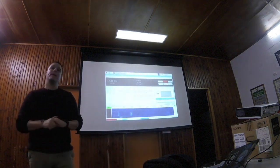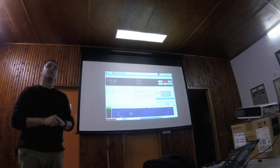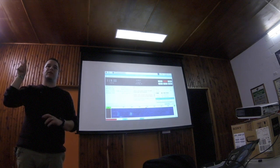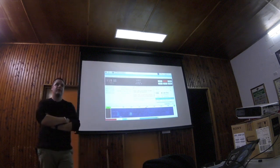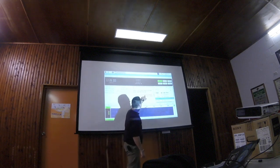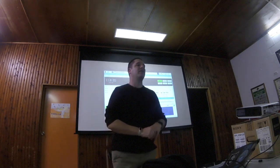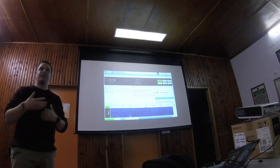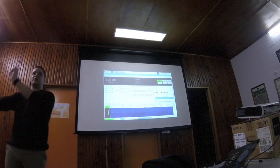Is the decode function decoding during receipt of the frame or at the end of the frame? At the end of the frame, or simultaneously, and then you get the diamond if it's all received, or the dot dot dot if there's something missing. So when you've got 7 frames, it's doing a frame at a time. When Pete replies, you'll see some, and then more, and then more. So even if it's only partial, you can start your reply. If it missed frame 3 of the 7, you'd get decode, decode, dot dot dot, decode, decode, decode, decode.